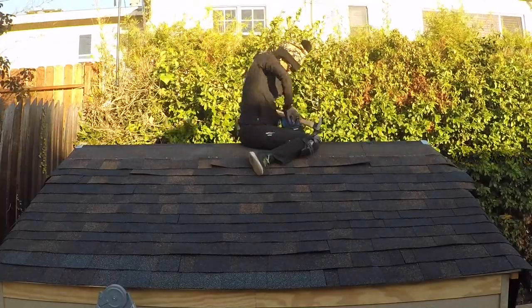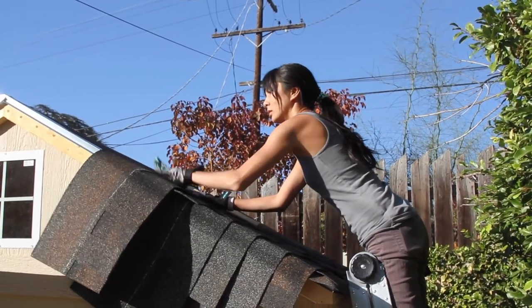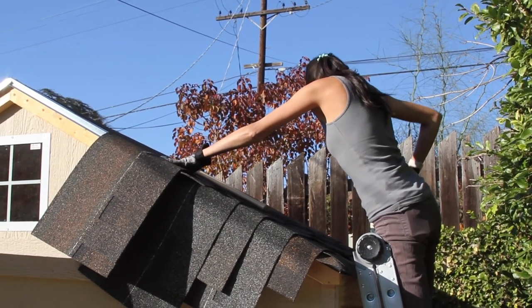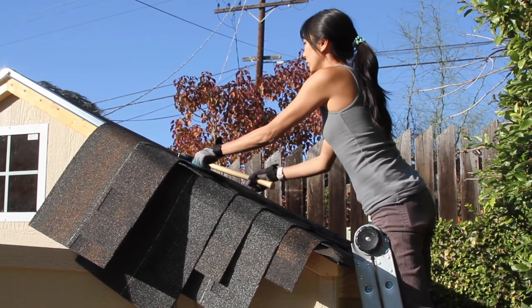Okay, but back to the build. I just took all of the shingles and staggered them so that the open lines weren't going to hit directly on the roof paper. You're staggering everything, and there's going to be all this excess on there, which is fine because I'm going to take my hooked blade and slice that all off.